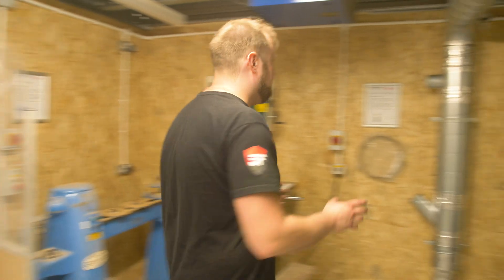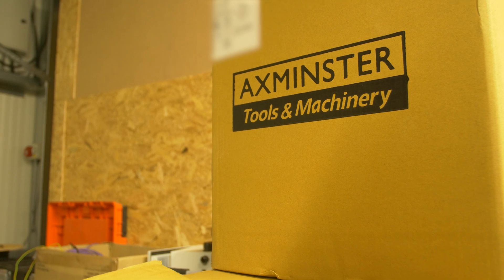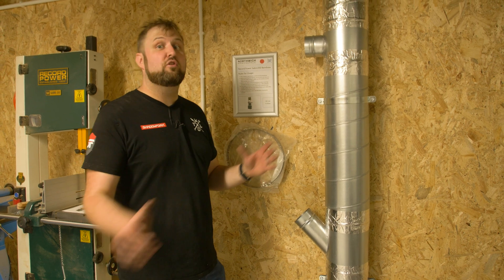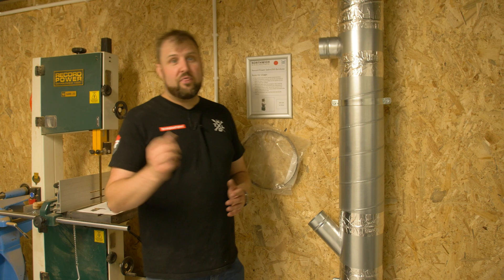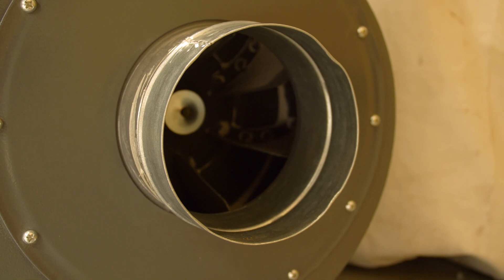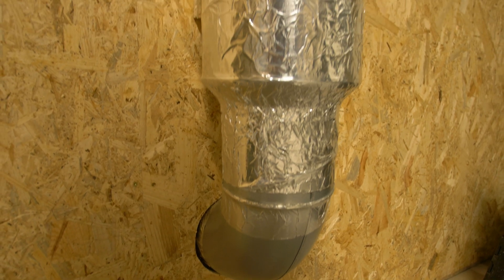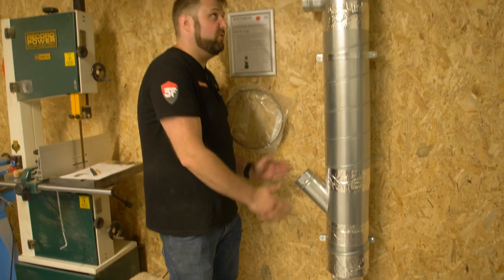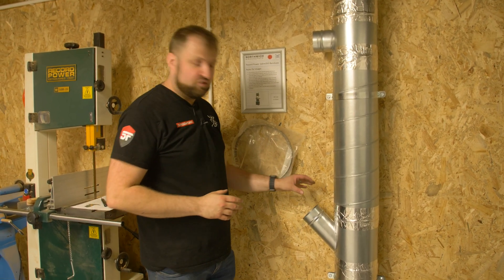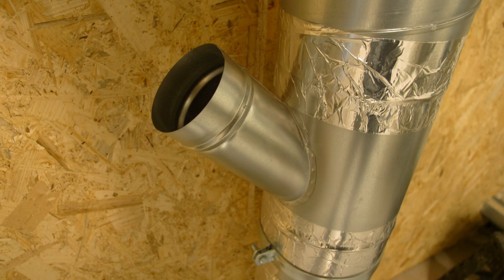So we're getting there now — I think I've found my way with this ducting. I had a meeting with Axminster who came out, looked at what we needed and helped advise me on what ducting I needed. The one thing they told me was that you want the widest metal ducting you can get for maximum airflow. So we were restricted by the 150mm intake on the extractor, but as soon as we came around the corner we used a reducer to take it up to 200mm, and then we've got 200mm galv pipe going all the way to the top and all the way along this leg. Where we're going off to the machines we've got 100mm takeoffs, angled with the airflow.